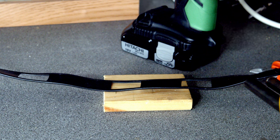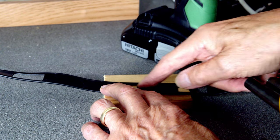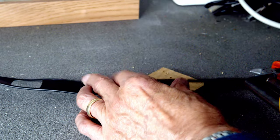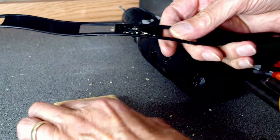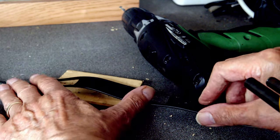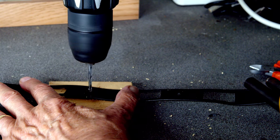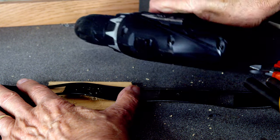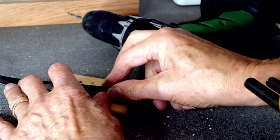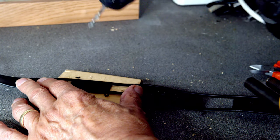What we're going to do is drill some holes in this 450 ohm ladder line — a hole at every one of these insert sections. So we take a drill and get it in the centre, just like that. We've got a hole there, and we're going to carry on drilling holes, moving this section along until we've got holes in each section. You need to measure out the ladder line first so you know how much you've got to work with.